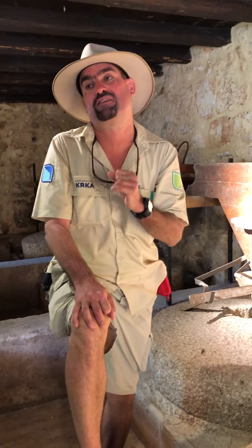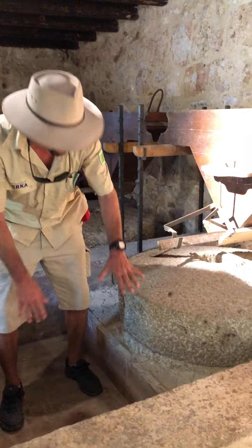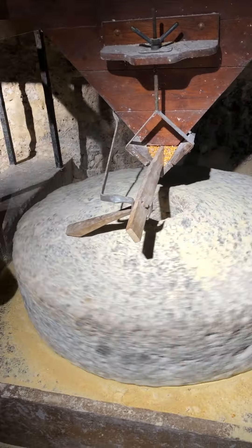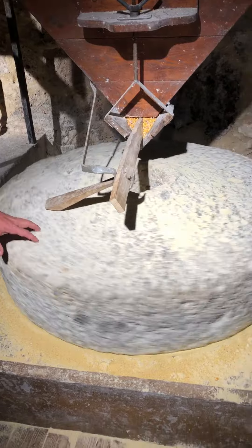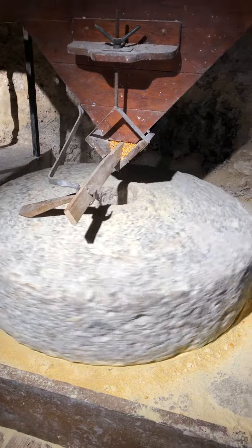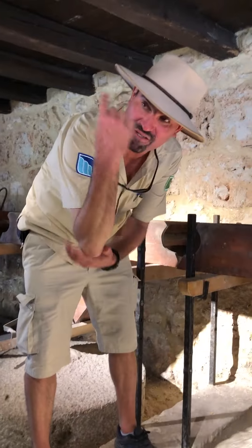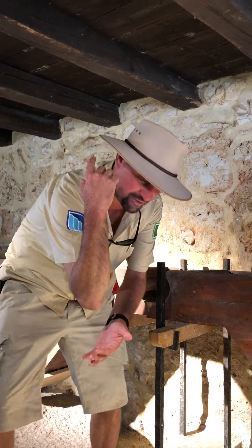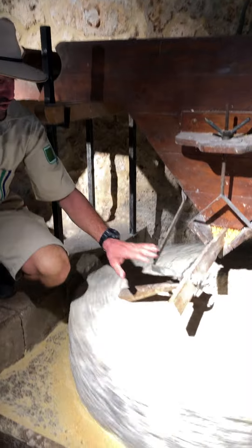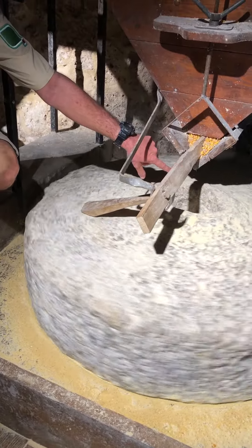The design of the mill is an antique design, a simple design. Each mill has two stones. It's being powered by water — water comes down the channel and below there's a turbine. As the turbine turns, it's connected to a shaft, an axle, and the top stone turns. As the stone turns, the stick vibrates and you can see the corn falling in bit by bit.